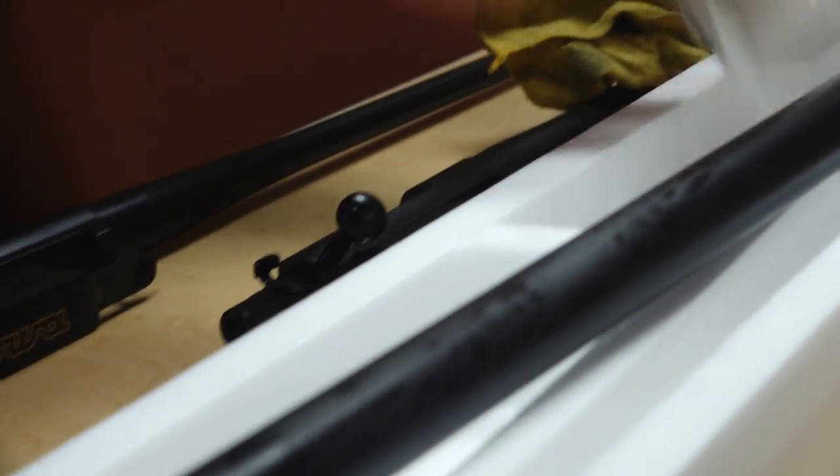And what they mean by cold is basically room temperature. They don't heat it, they don't stress the steel at all. And then those hammers, tons and tons of force, are gonna hammer the barrel into the desired profile. It's gonna be machined afterwards, and stress relieved, and then there you go, there's your accurate barrel.